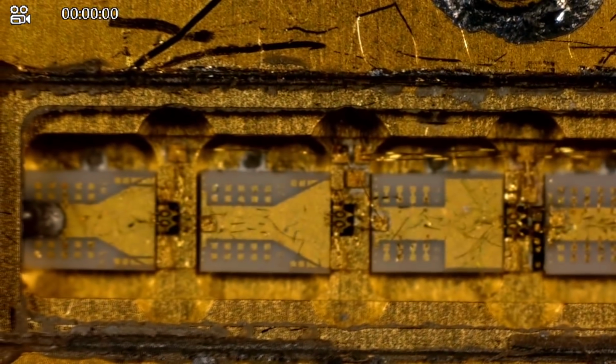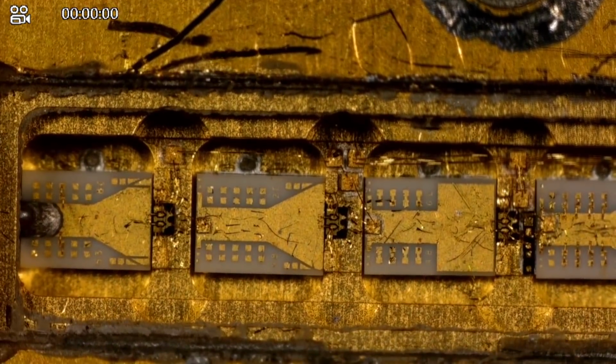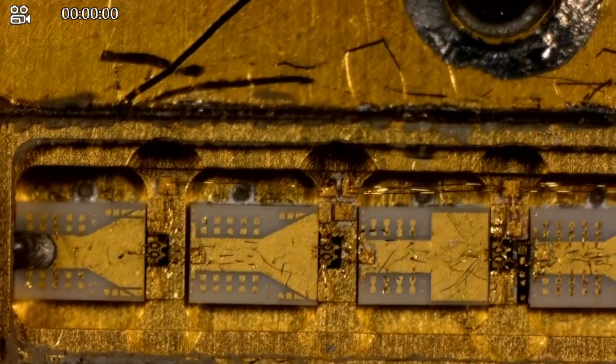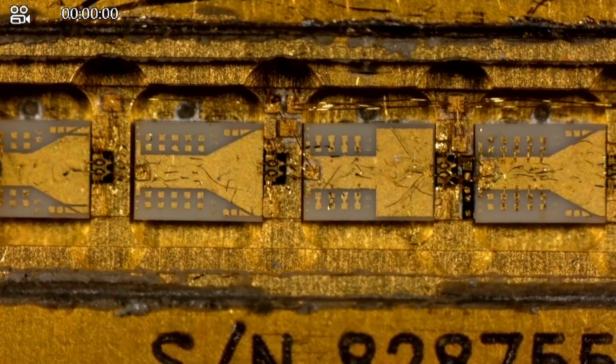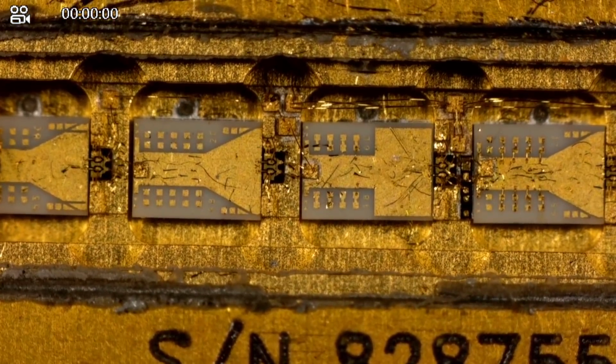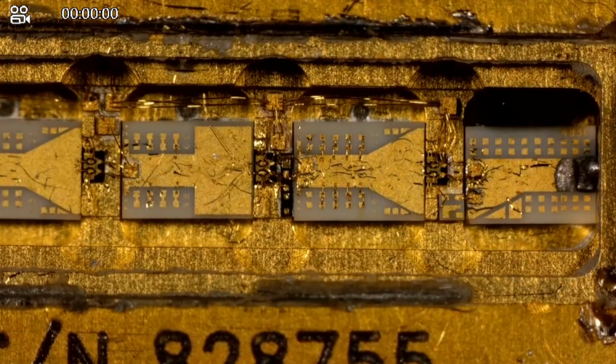And then they go into a series of capacitors which are mounted everywhere. That's how they distribute the bias. You can clearly see it. These long bond wires running everywhere, and then go into the ceramic pieces. Very nice. There's some decoupling capacitors on the ceramic pieces. You can see the outputs going directly onto them. That's how they decouple the stages from each other and prevent their biasing from interfering with each other.